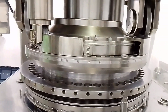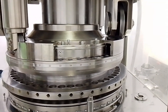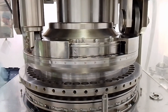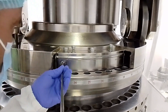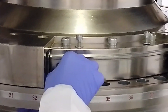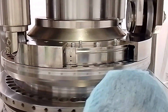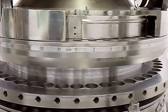So this is our compression machine. We have removed the old punch, or we can say it is a new machine we have to set up. First, we are looking at the compression machine and from here we have to remove the center part with the help of a screwdriver — very carefully. I have loosened both screws and will remove them. From a safety point of view, you should be wearing proper gowning and gloves. I have removed the center cam. Now I will rotate from the bottom and set it on the number one punch, starting from number one so we can proceed serially.